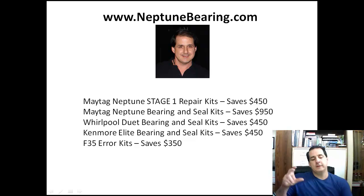Okay, so the machine has to know when you hit those levels, because you don't want to overfill and flood your house. So what they did was they added an analog pressure sensor, because before you had two snaps, that was it. Where's the water at here? You don't know. But with this analog sensor, it gives you a representation, 0 to 5 volt, of where the water level is. So they know precisely where that water level is.